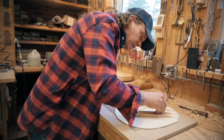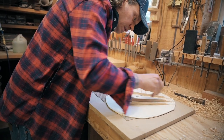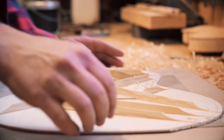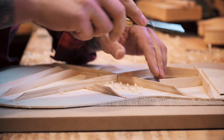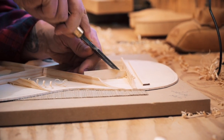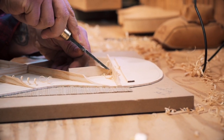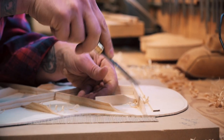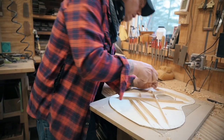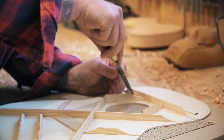I'll go in here — these are all red spruce, just like the top — and I want to shave these down so they kind of meet up right. I don't spend a whole lot of time sanding braces; a lot of people will do it, but I mostly do chisel work and planes and leave it a little bit rough-cut. I like seeing traces of edge tools better than sandpaper, given that my chisels are sharp.